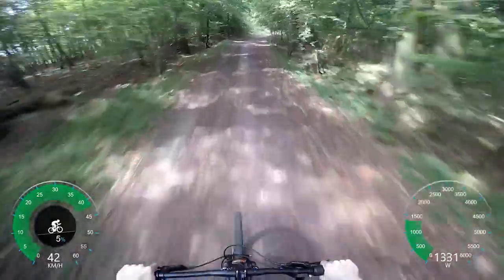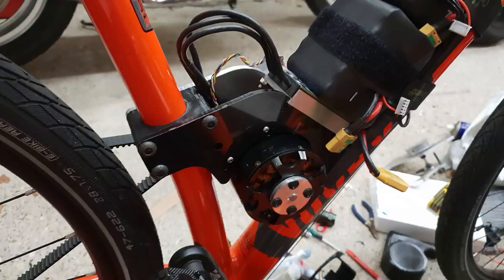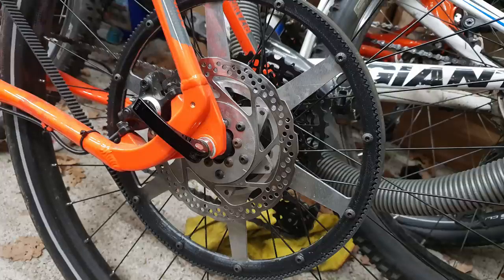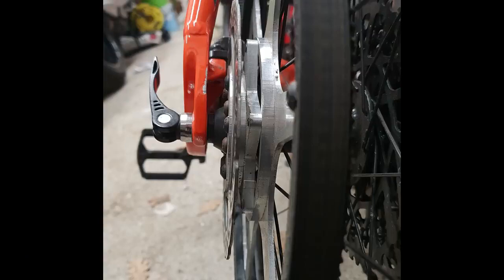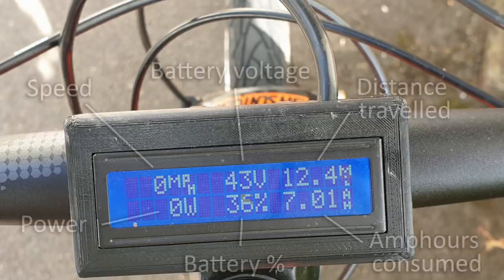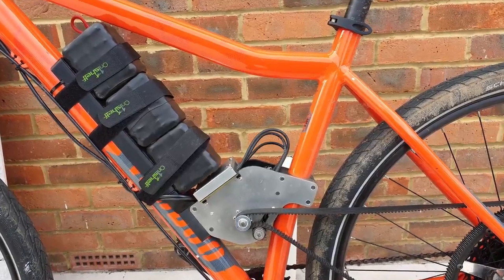But a lot has changed since then. The dual pulley setup produced a lot of noise and resistance which reduced efficiency and range. So I flipped the motor around, made a new mount connecting the motor output directly to the main drive belt, and completely redesigned the large rear pulley to be manufactured from a single piece of aluminium — removing the need for individual spokes and spaced away from the brake using aluminium discs. I also programmed an Arduino board to gather serial data from the speed controller and display important information on an LCD screen.